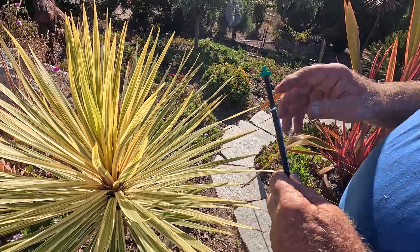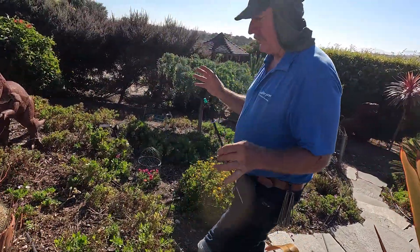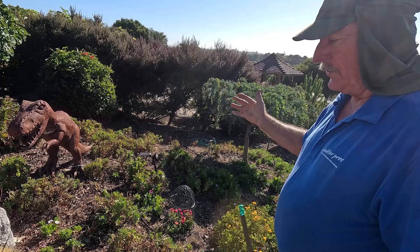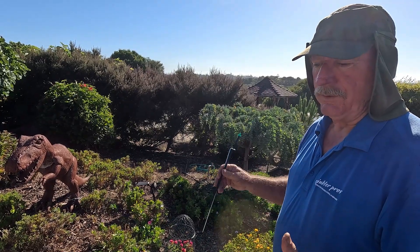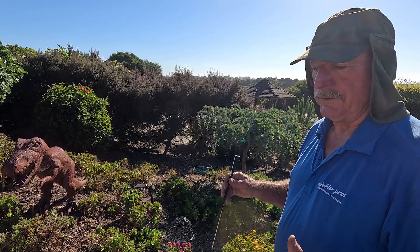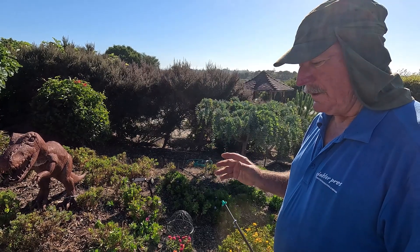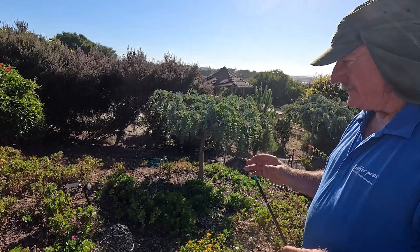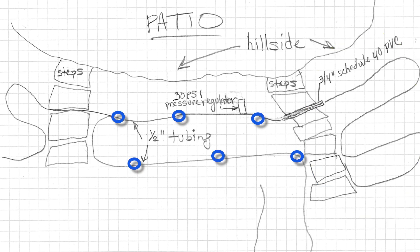With these being five-foot sprays, from experience I've found that for good coverage you don't need to have them five feet apart. One reason for putting them a little further apart is to cut down the load on the line — you want as few as possible while still getting coverage. You don't want to skimp, but the fewer you have on the line the better so you're not overloading it. I found that having them seven feet apart and alternating them across multiple horizontal lines works well.